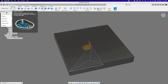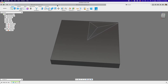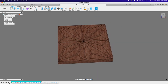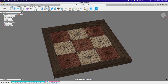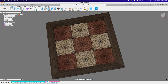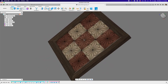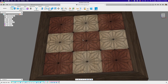That's great for CNC milling. You can right-click and post-process, get some G-code out of that and run it on your mill. But if you go back to the design workspace, you'll notice there's nothing there — everything we did was in the manufacturing workspace for CNC milling. In my fun experiment, I created this in the actual design workspace — I actually modeled the shape. I'll show you how to do that. You can see in my timeline I have this art-framed bit where I took nine of these tiles — the idea is to CNC them out of different species of wood and create a checker pattern with a frame.